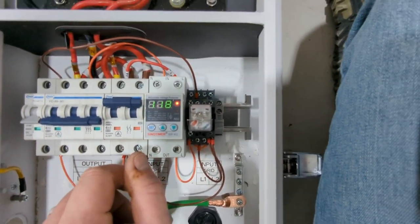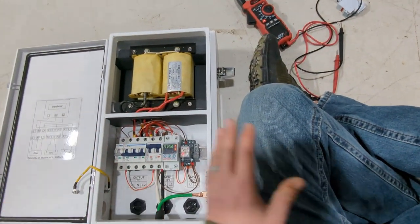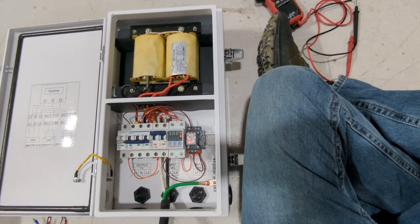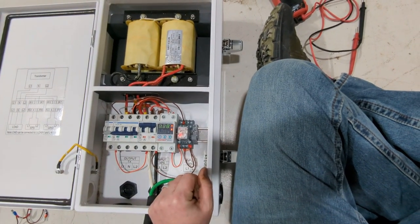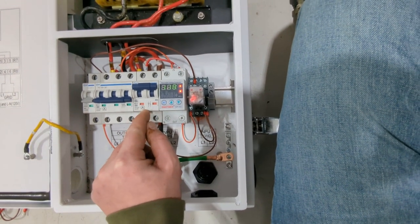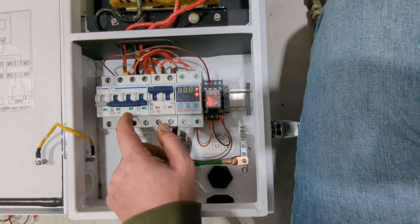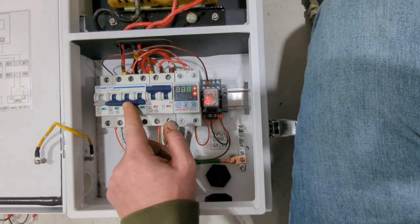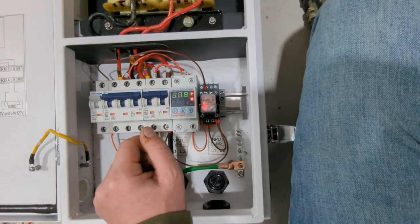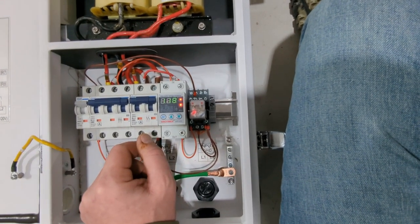It's real simple, real easy, no extra cases required. You buy this Growatt 11.4KW ATS model. Make sure you get the ATS model because it's got a little more space down here, and you can add this stuff in. These are UL listed. These breakers here are these UCO breakers. I can't find any other shunt trips out there, maybe another brand. There's pretty much no supply out there of shunt trip breakers that aren't $400. So anyways, that's all I got for you tonight.